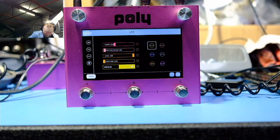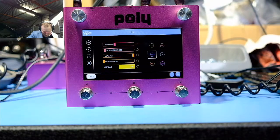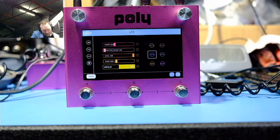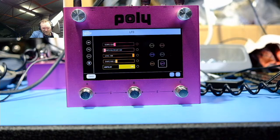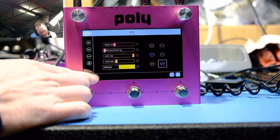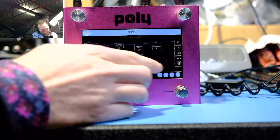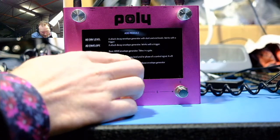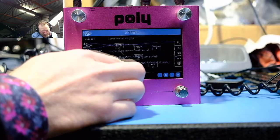Now we can have different wave shapes, including these ones, which will obviously click at the start of their shape. And we can have the random, if we would like that. Obviously the random is a bit adventurous by itself, and clicky and weird, so unless that's what you want, it's probably nice to run a slew limiter after it.